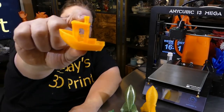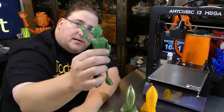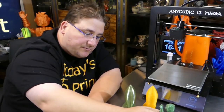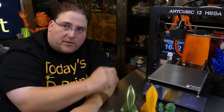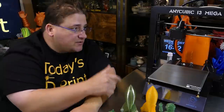Look at the stringing on this TPU Benchy — there's almost none. That's unheard of for a flexible filament; that's impressive. There's a little stringing on the PLA one; I think that's the nature of this PLA needing to be printed hot at 235 degrees. But I love it. Thank you very much to those who suggested I get this printer. I would give this printer a provisional yes — buy it. I don't see anything that screams beware. It's a good standard printer with advanced features like power-off resume, filament detection, and the big one: this ultra base. It's nice.